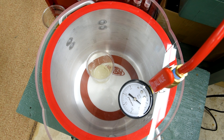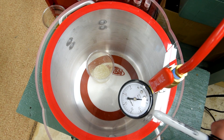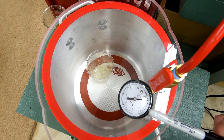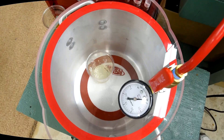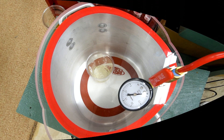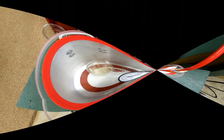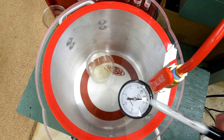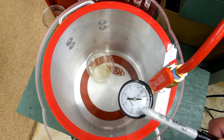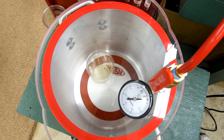The Envirotex, on the other hand, is acting pretty much the way I had expected. Those little tiny bubbles that I had created when I was mixing it — they've expanded something fantastic, and that's what makes it look like it's boiling. The Envirotex itself really isn't boiling; I don't think it's evaporating at all. You should have seen it yesterday when I had that little piece of wood in there — I had to keep turning the pump on and off or it would have boiled right over the cup. So I've got to figure out a way to submerge the little piece of wood — in my case, it's going to be a pen blank — after everything has settled down, while everything is still under vacuum.